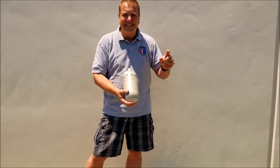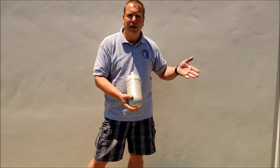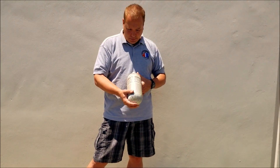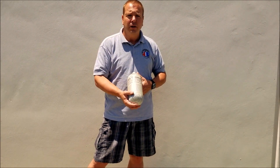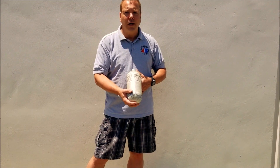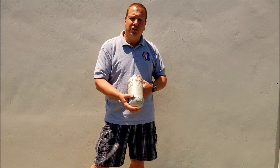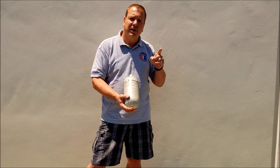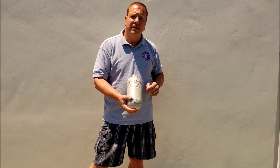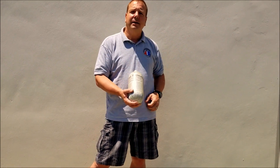Make sure you keep your tanks in hydro. Look up hydro test — if you can't find somebody locally, go to a scuba shop or a paintball store. Keep your tanks in hydro because nobody will fill them otherwise. Even if you're filling them yourself, you owe it to yourself and everyone around you to be safe. Take care and God bless — this is Joe Brancato of the Airgun Scientist. Don't forget to like our Facebook page Air Tanks For Sale and follow the Airgun Scientist for the latest discounts.